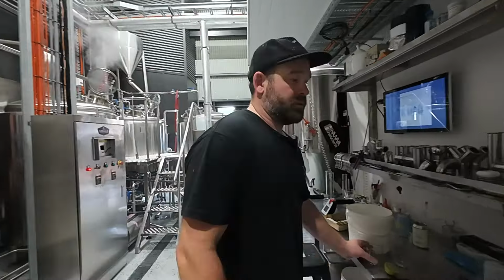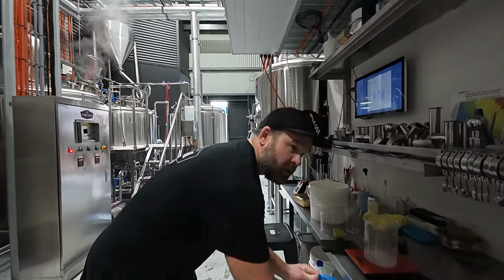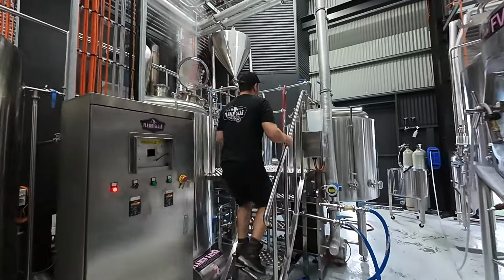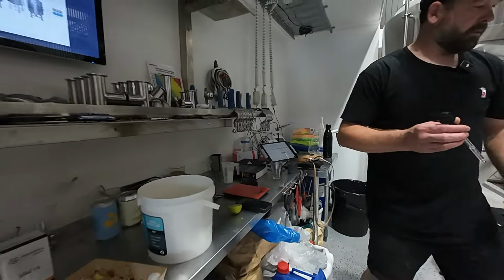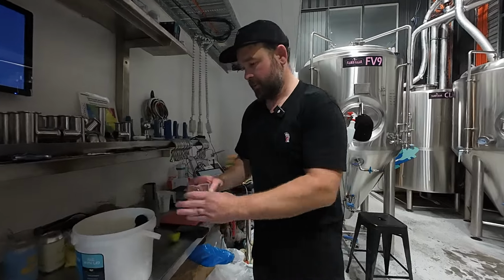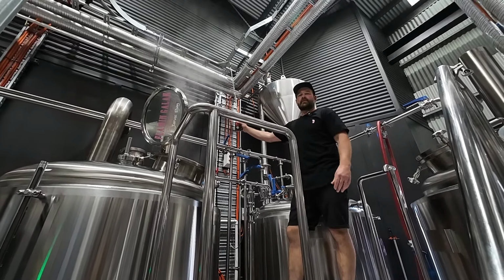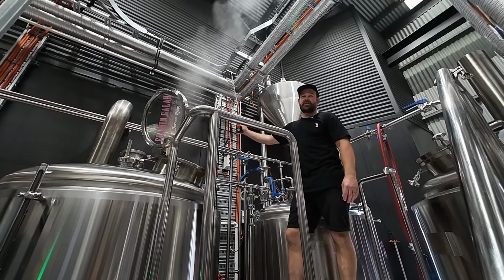I've been doing 200 gram additions, so I'm just going to slow up and go back to 100 grams. 100 gram addition. Take a sample, so we know our DO's right now. We'll switch that meter off. Just chasing our 4.7 on the pH. Hello YouTube again. I reckon we made our pH, but we'll see. The further down the pH scale you get, the harder it gets to reach. You know what I'm saying?